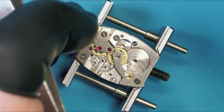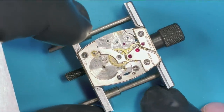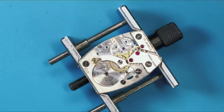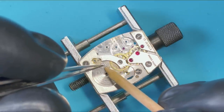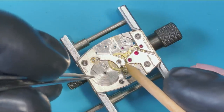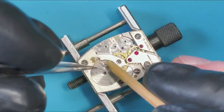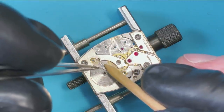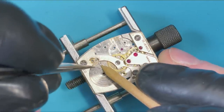And we are now going to put the click spring in. And these are always a little bit of fun. Just need to get it looped round its post. Hold it in position. And then make it jump all over the place. So it's just vital that you hold these things in position as best you can. Some people like to use a bit of Rodico. I just tend to find that Rodico sticks to everything afterwards. Then you have a job trying to clean it up. Bit of pegwood usually is enough for it to not go anywhere.